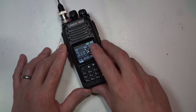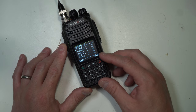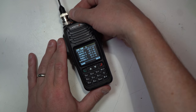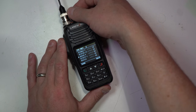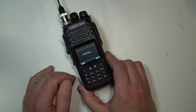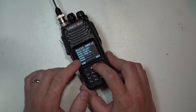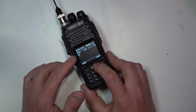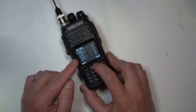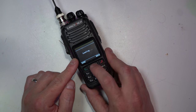To access the APRS beacons that it's picked up, you hit the pound sign. You can see your GPS is off right now, so we're not collecting any data — that shows GPS first. If you click it again, you will get a list of stations. There was my station that beaconed. If you click 'sure,' it'll bring it up. Going down the list, you can find different stations that you've collected beacons for, and clicking the green button gives you information pertinent to that packet — who it was picked up from and whatever message they might have configured.